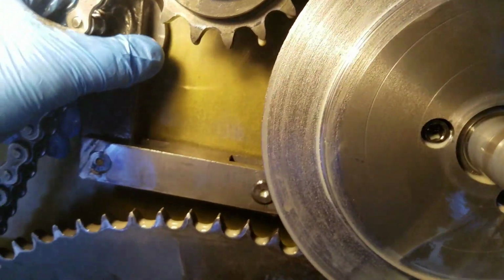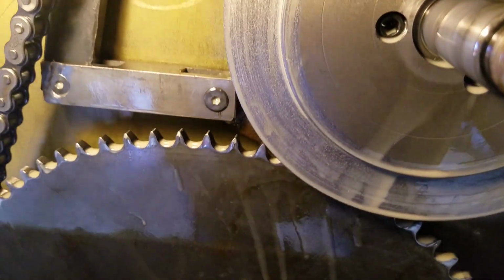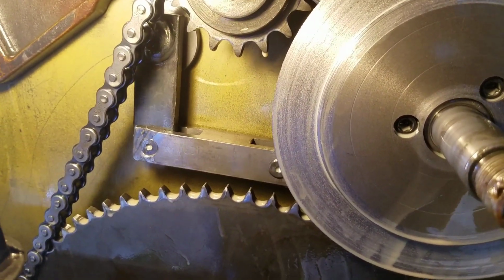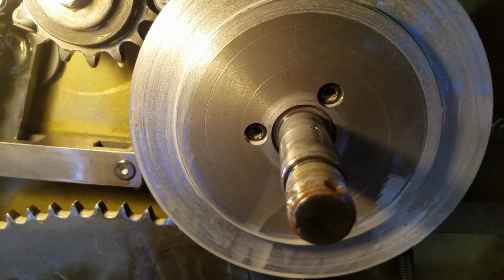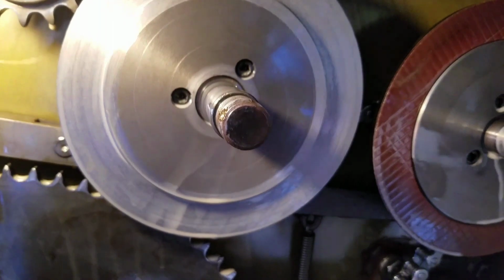And actually, I take that back. This is pulling the lever backwards. The lever's not supposed to go as far. It's only supposed to go, like right there is about neutral position. But because this clutch disc had worn out so much, it was allowing this to get pushed up in here, and I bet you that's why that's rubbed right there. If you look at the back side of the chain, in most places it looks okay. We're going to leave it be.